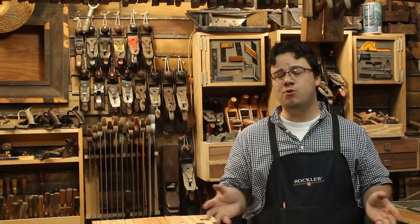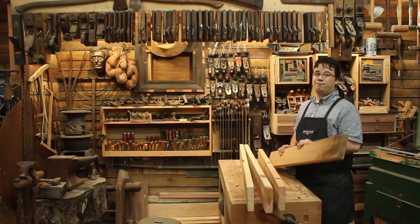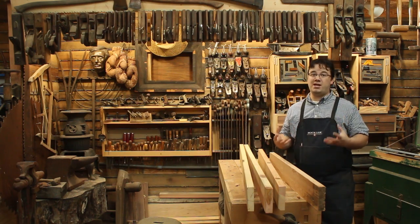And I just happened to have on hand some very old, dry construction lumber, just begging to be turned into a workbench. And who am I to deny a 2x6 its destiny? If you're going to be making your bench entirely with hand tools, the 2x6 is your friend. Edge plane them down a little bit and you have nice 5 1/4 inch wide stock without having to do a bunch of hand ripping.